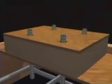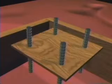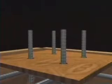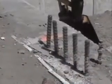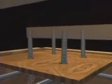Now that you know where the dowels are to be located and have them ordered, the key to securing them in the form is to make simple 3-dimensional template assemblies. Most contractors use a template to position anchor bolts and try to adapt this system for the rebar anchor dowels. The problem with using a template is that it only holds the bars at one elevation. The bars can pass through the template at an angle, and with the lengths required for embedment in the NMB, this angle becomes more of a problem. Larger diameter bars are difficult to bend, so accurate initial location is very important. With the assemblies having support at 2 levels, the bars are located both horizontally and vertically.